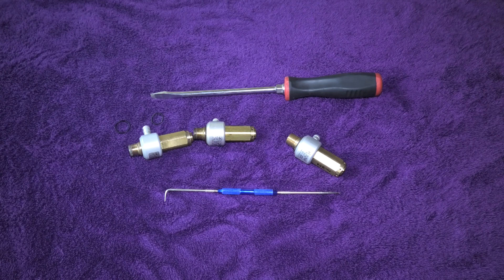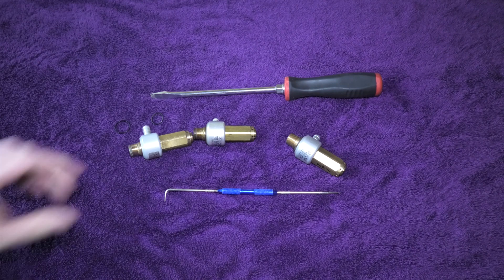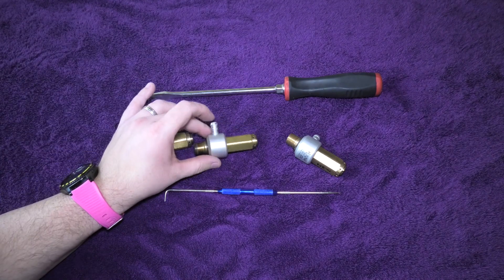Something a bit out of the ordinary — today I'm going to be doing a video, don't know how long it's going to be, and we're going to be looking at these Interpump S284 safety relief valves. You may or may not have one of these on your washer. These are predominantly fitted to machines that have got higher output pumps. My machine has got a 350 bar pump, which is restricted to 250 bar, and these are basically a fail-safe device.